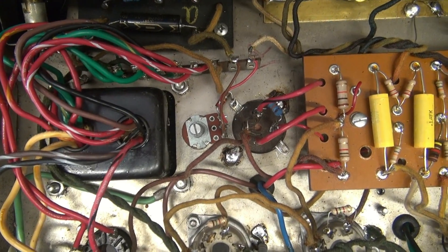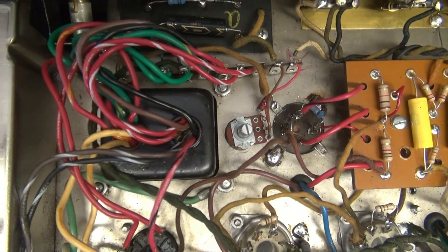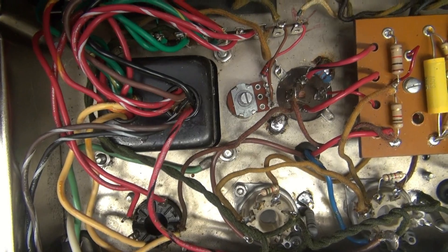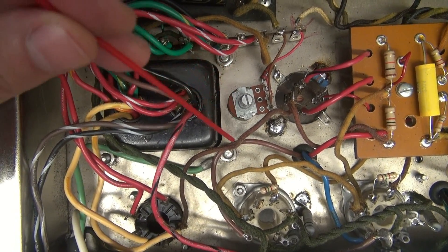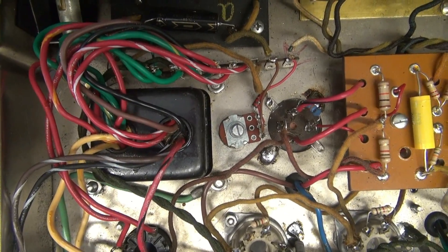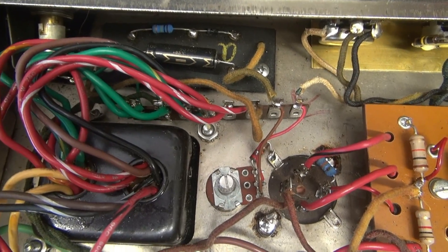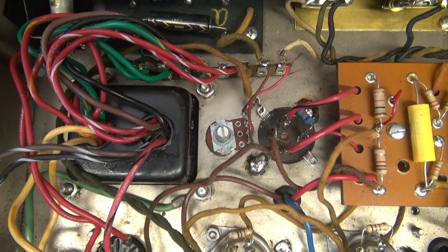Here's the underside of the amp. Current power transformer — you can see the opening here, there's a lot of room around it. There's a terminal board I'm going to have to remove. The bias pot's going to have to move. That should allow plenty of room to open this up, around a half inch all the way around, to accommodate the new power transformer. The bias board is hanging out back there — I don't think it'll be in the way.